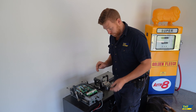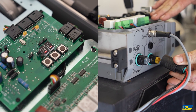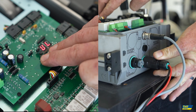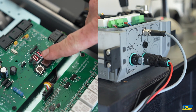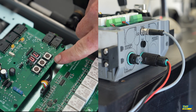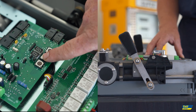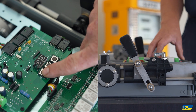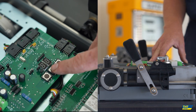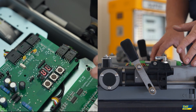To conduct the initial stroke setup for throttle and gears, you have to disconnect the power plug on the front so the system powers down. You then hold down the up and the down buttons and reapply the power plug. You'll see that brings up 'UL'. The U represents the throttle function; L represents low, or in this case idle. We then press the enter button so UL flashes, then use the up and down buttons to physically move the lever until we get it in exactly the right position on the rack or lever on the side of the fuel pump for exactly where idle is. Once happy with that, press enter to save — that is now saved forever.